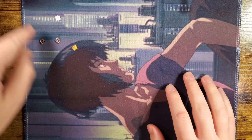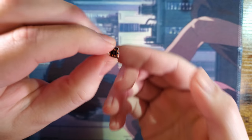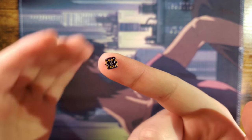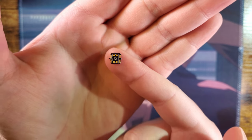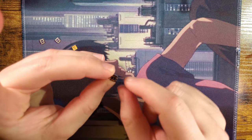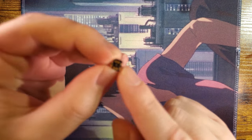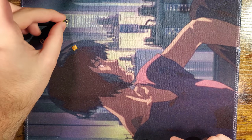I made breakout boards for these things. So I made little itty-bitty PCBs. I actually had to size this thing up several times just to get it past the minimum size requirements. And all it is, it's a breakout for that chip, so that I don't have to try dead bug soldering to it, which I did try. It's just a little bit too small.